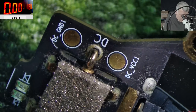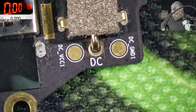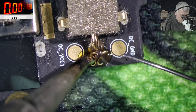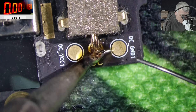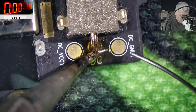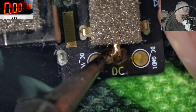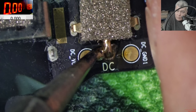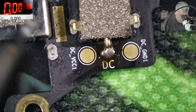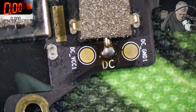Perfectly clean. All I have to do is solder this pin there. Check there — you can see how it's moving. We need a little bit of rosin. Rosin there. And we have to solder the port. We have to heat up the port first. We have two test points — you can check the voltage on the board using the test points. The pin is now soldered on the back, but I also want solder on the front. We have to be sure the solder bonded all around the pin. The pin is now soldered properly in place.